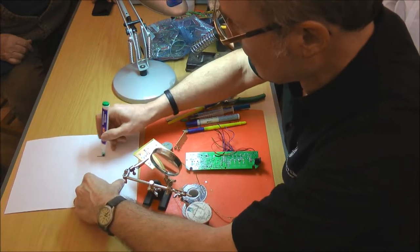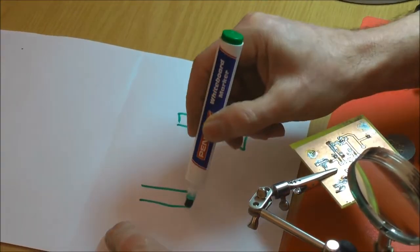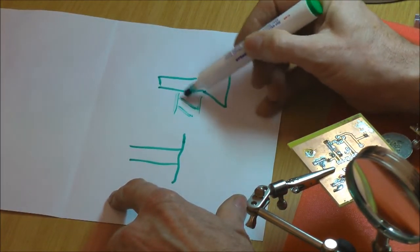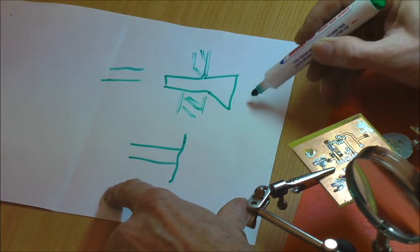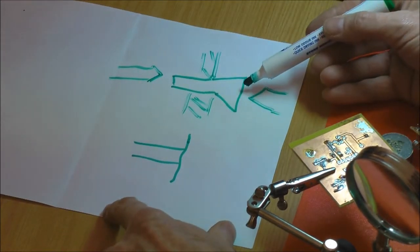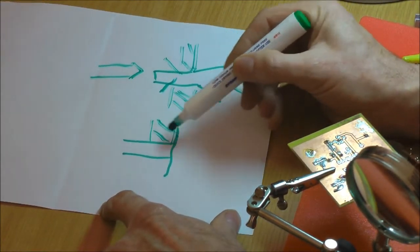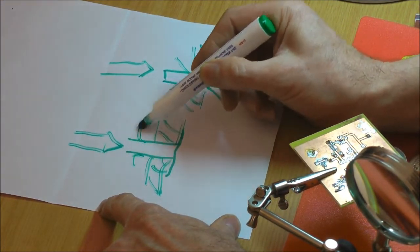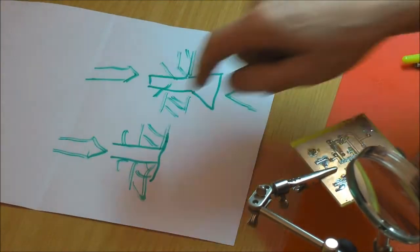As I say, there are two types. One looks a bit like a screw, but hollow, and the other is almost identical apart from the top being flat. You put it through your circuit board. Then you have a crude flaring tool, with a point on either side. You keep it in the board with that and press, and you mechanically flare it out. This one is the same, but the top is already flat, and you insert a flaring tool which pushes that out. You get a mechanical joint that you can then refit your component to, and then flow solder around it to wet both sides.